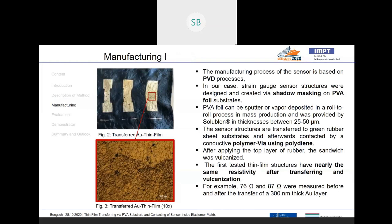Concerning the manufacturing, we started with applying PVD thin film structures on green rubber. As you can see in Figure 2, the substrate is very rough and not planar at all. Therefore, it is very challenging to apply a good sensor structure onto such a substrate, but the PVA can be used to address this. In the third picture, you can see that we have an applied thin film on the rubber substrate and microcracks occur, which do not lead to a loss of signal. We used a PVA supplied by a company, with thickness between 25 and 50 micrometers.